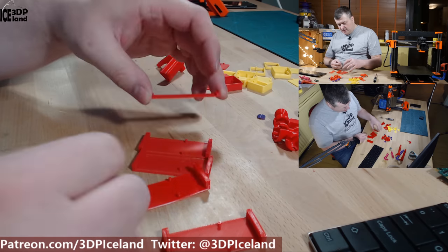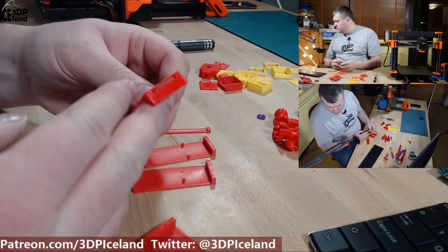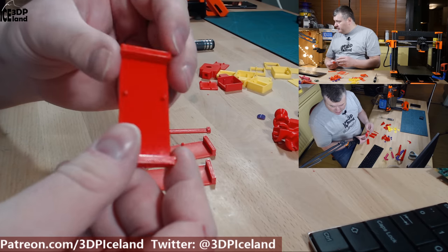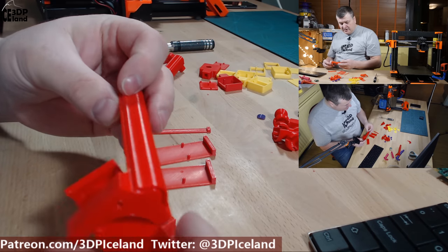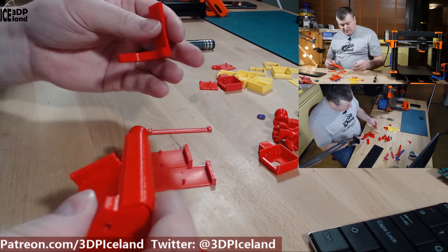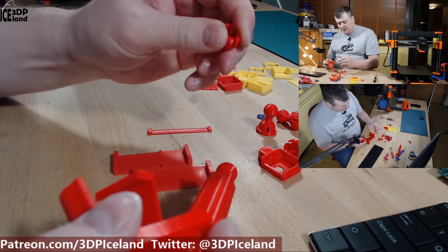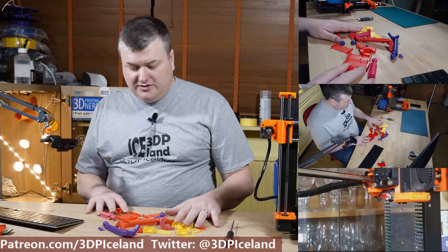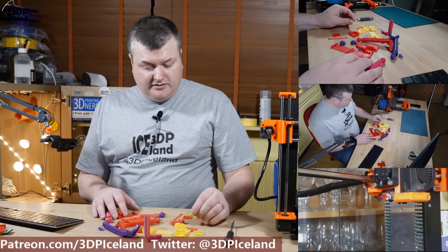The piece holding the extender went through several iterations to get the correct fit on the back of the electronics cover, testing different thicknesses and stiffness. The final design has the cable going through the back side and is rather thin so it flexes a little. It's printed in a PLA/PHA filament which has more flex than normal PLA, and that works well. The camera housing works fine with normal PLA, but I still need a better filament for the links as PLA is too brittle and snaps when removing or installing them.